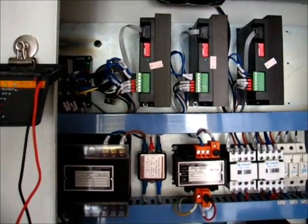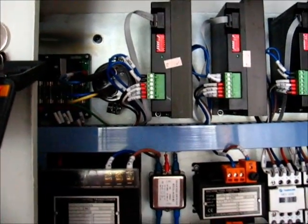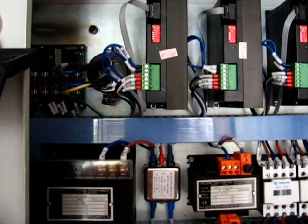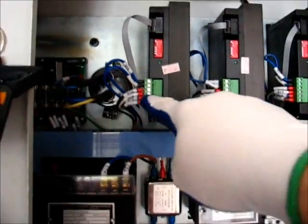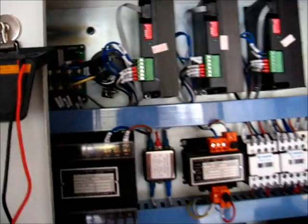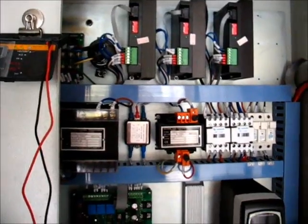I checked that out and probed at the terminals — everything worked fine. Then I disconnected the wires from the green block and checked them individually, and the results came out the same. So that tells me that the stepper motor itself is good.